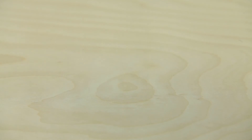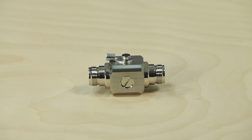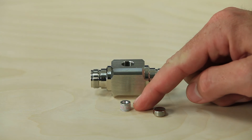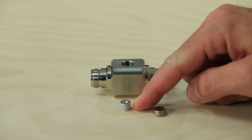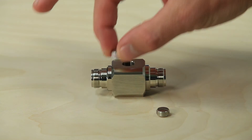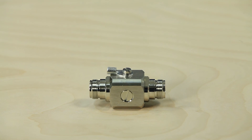As an insurance policy, be sure to install a lightning surge protector in case lightning strikes your donor antenna. These are very low loss, so you don't have to worry about them affecting the signal much, and they come with a replaceable gas discharge element. In the case of a lightning strike, the electricity travels down the cable to the lightning surge protector and is discharged at that point, protecting all of your downstream equipment. You simply need to replace the discharge element and you're back up and running.